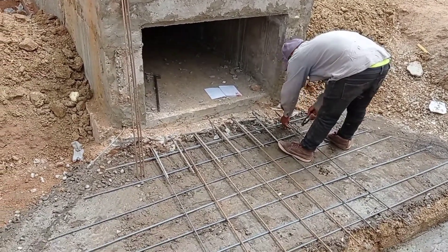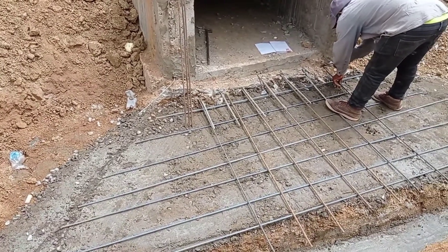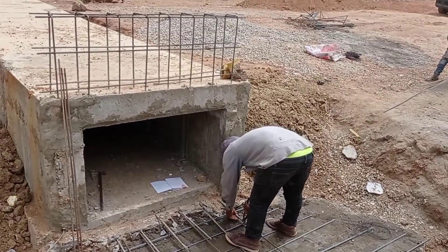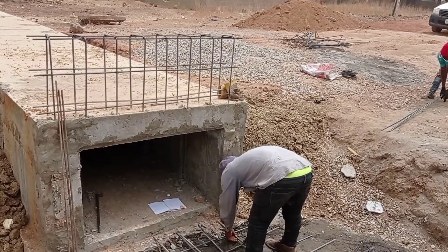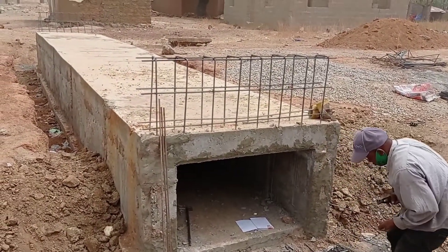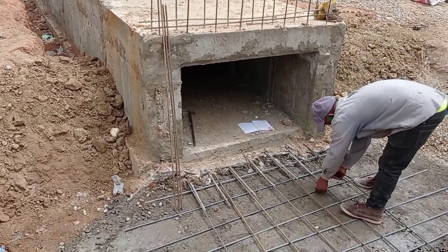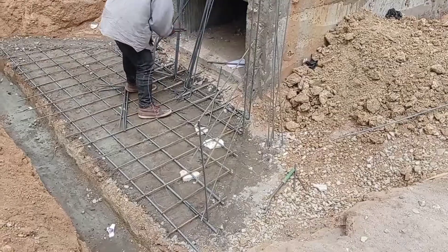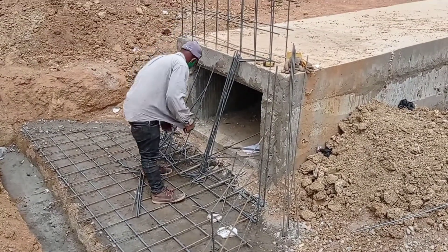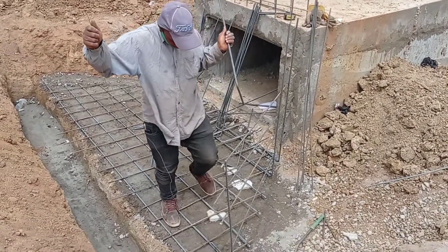You can see that the overlapping has been maintained at approximately 35 centimeters. Make sure you always do this overlapping whenever you are doing the reinforcement works. For the construction of head wall, wing wall, and apron, we have used Y10 and Y12 mm bars. Y10 have been used as the runners while Y12 have been used as the short bars.